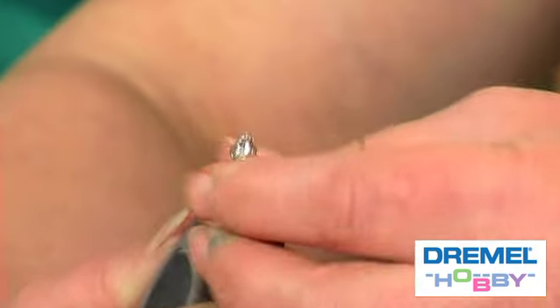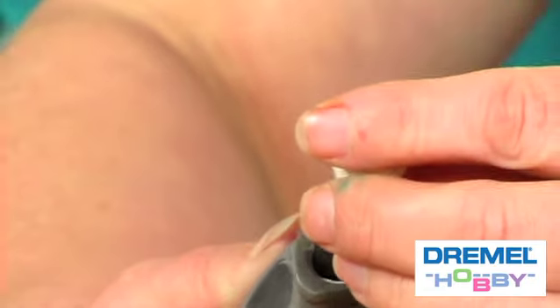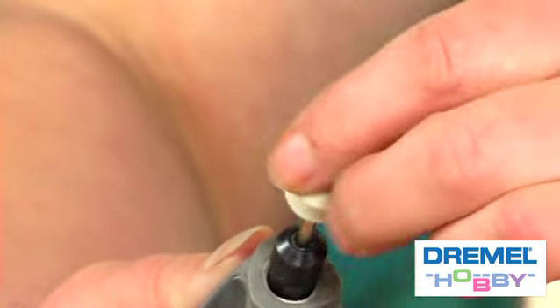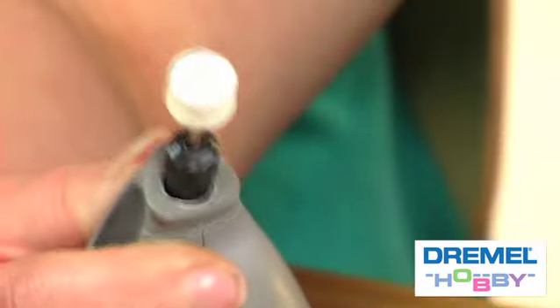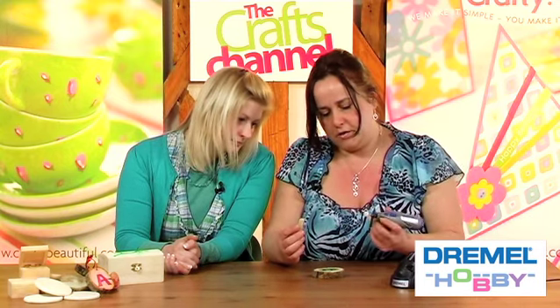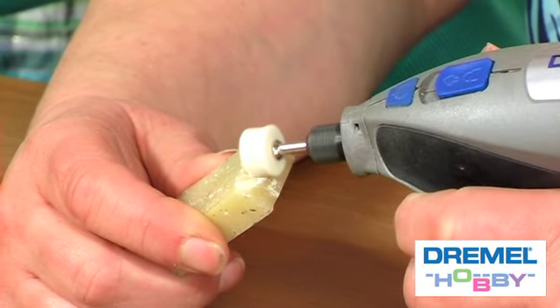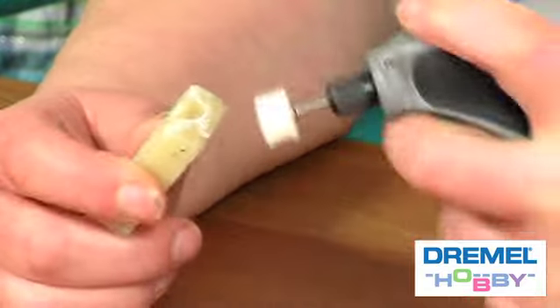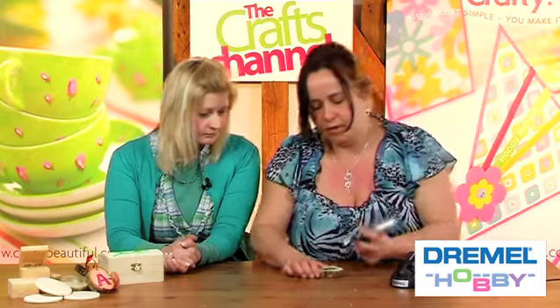The monogram that I've done there has actually been varnished, but beeswax works beautifully. What you do is change your tip and pop in one of these shafts which has a screw tip on the end of it. Then you get a felt pad that simply screws onto the screw tip, so they're interchangeable — like this. If you get a block of beeswax and turn this on, rub the end in the beeswax, the friction will melt the beeswax onto the felt pad, and then you can apply it.